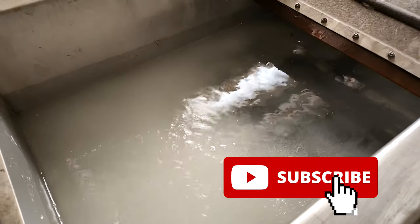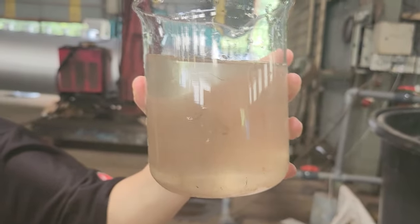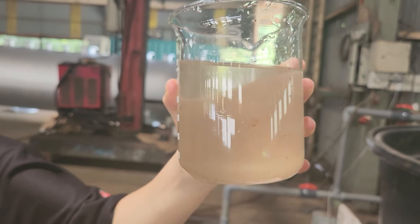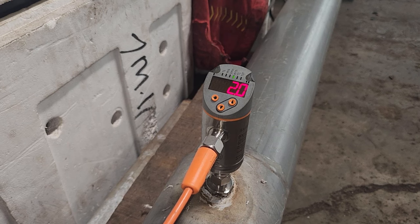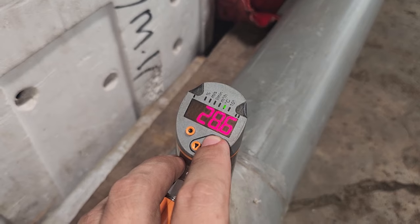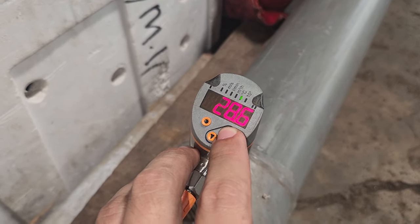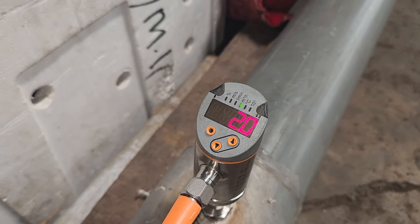Back to today's topic on the efficiency of this dissolved air flotation. As you can see, after we added in some dirt — sand and particles easily found in any pond — it pollutes the water once added. If we start to run the system, we can see by the flow rate sensor that we're running about 2 m³ per hour. This is a small unit compared to commercial units, and this small flow meter mounted on the pipe can give you readings like temperature and flow rate in different units. The DAF unit is quite sensitive to water level and its ability to remove waste depends on how much water is being fed into the system.